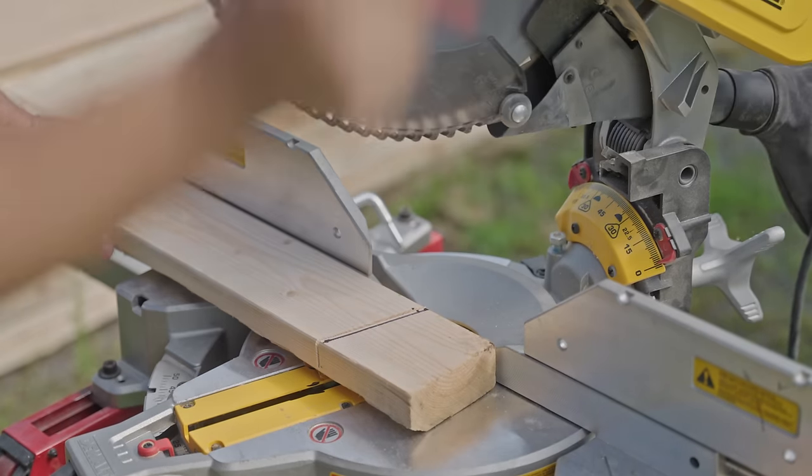I'm going to get Matt to come up here and do the rest of the blocking. We want to have no air coming in here except through the vent that we're going to install. All right. Once we get that done, we've got to do the gable ends and get our sheathing on. We're going to do the roofing, hopefully by the end of today, because the weather forecast is very spotty this year, and I don't like getting my tools soaking wet if I can avoid it. We're blocking. Once we have our roof on, there's going to be a hole going up here, and we don't want rodents and stuff getting into the structure. So we're simply going to put blocks in between each truss, so that once our plywood is on, there's no possible way that things can get in.